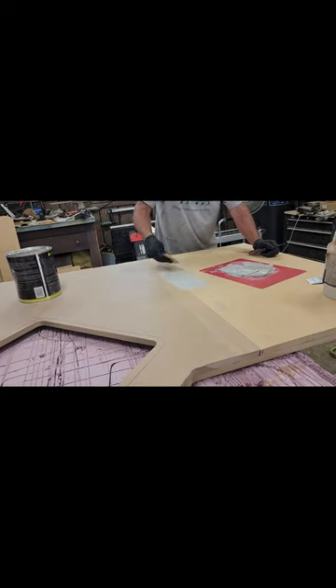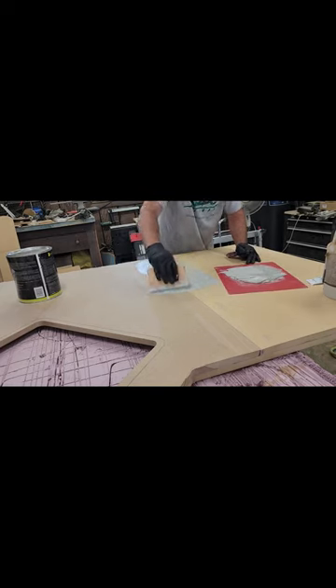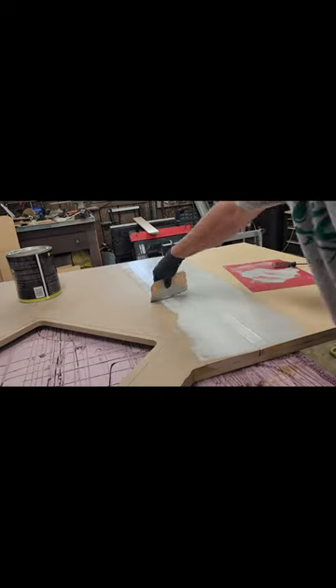What's important to me is that first layer — I'm going to get it pressed into the pores as good as possible, for as far out as I know I'm going to feather those edges. Getting it pressed into the pores of the wood, I know I'm going to get my best adhesion. As I'm applying the bondo, I'm being aware of where that valley is, and that's where I need the buildup. I'm running it very thin along the outside edges and making sure I have more buildup where that valley is. Now that I have all the bondo on the surface and fairly smooth, I'm going to take my drywall knife across that to check for any low spots, draw my knife back across it, and get it nice and smooth.